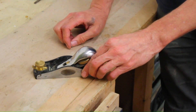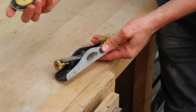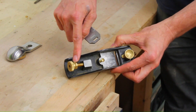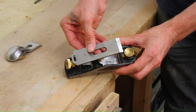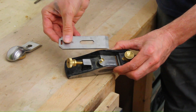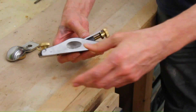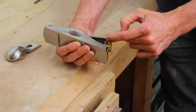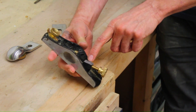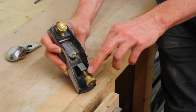To take it apart, what you do is undo this screw here and then the blade pops out. The blade engages with this screw there, so that notch has to fit into that. What was happening with this tool was the notch was popping out because the tolerance between the blade and the notch was too much. So what I had to do to get it running is I had to grind slightly this face here so that the blade sat closer to the screw.